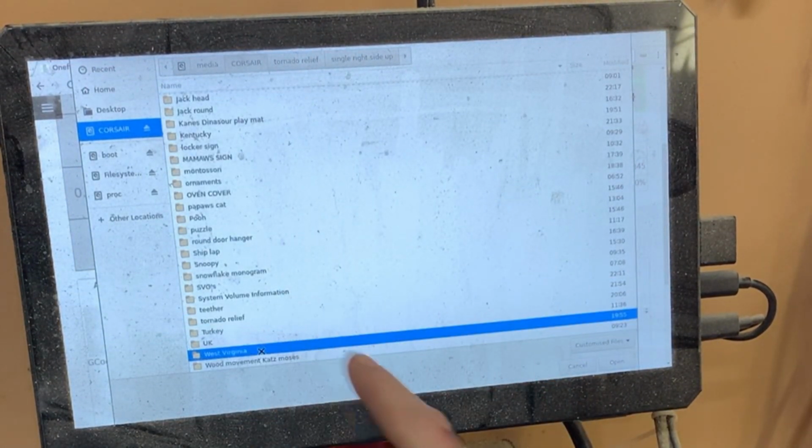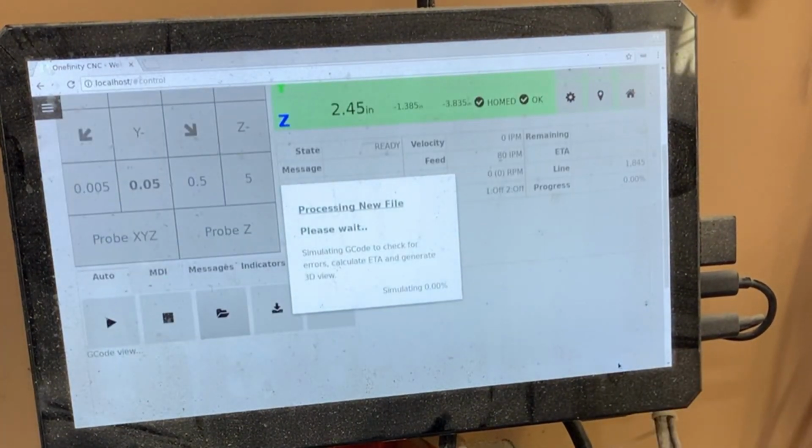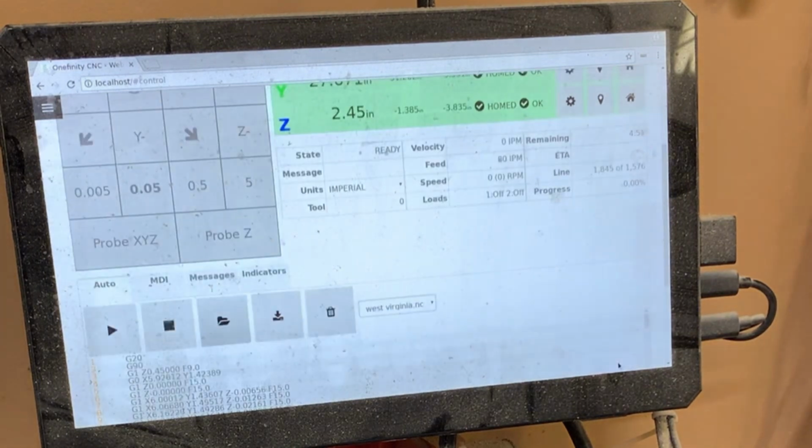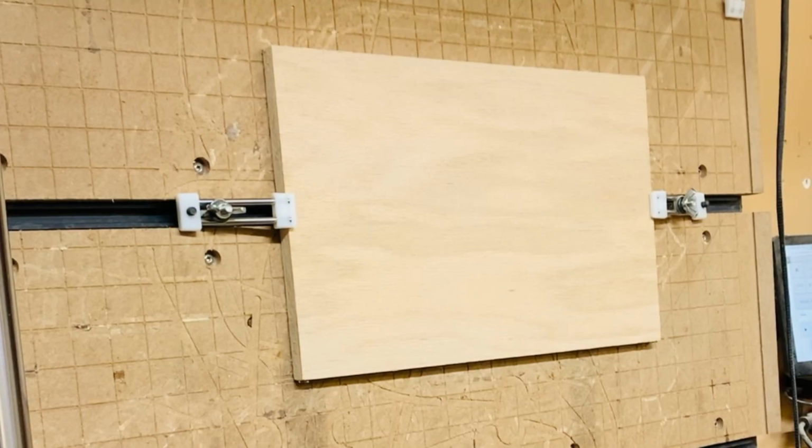The controller will then process the file and should give you a remaining time, which is the time the program will take to complete based on your system settings and speed. This includes your program speeds along with the controller settings such as jerk speed, etc. Due to this, you may find the time that your programming software told you the program would take to differ to the one now displayed.